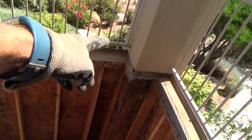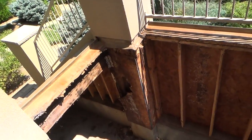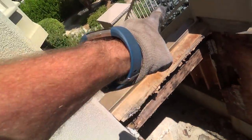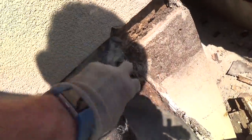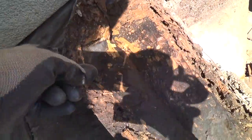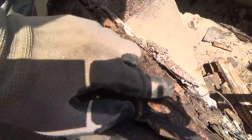cut that black stuff up underneath the column through there, on the other side over there. When I cut that out, that's all gonna be loose. That's all gonna pull up. And I'm gonna end up removing this piece here too. And this stuff here, see? Look. See how right there at that point, it failed right here on the joint because the other stuff went on top of this, remember? Went on top and over. So when the water went, it hit that edge, it went like that. And now you can see the damage it's done to the top.